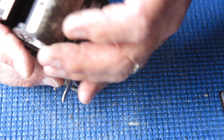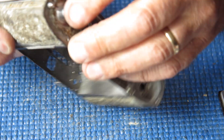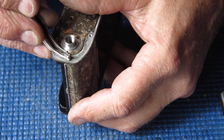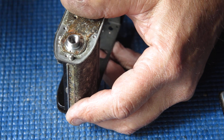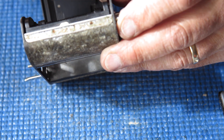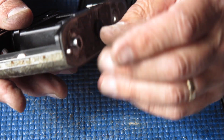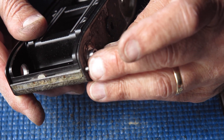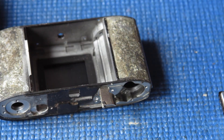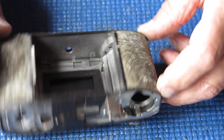I'm checking the action of the back catch. These can be disassembled if they're very sticky — you unscrew the button, which just has a couple of threads on the end, then remove two screws at the side, lift the plate off, and the bracket and return spring come out with the button. Putting them back together is a bit more entertaining — I normally use a pin vise to hold the button while screwing it back in, as it's just too short to grip with your fingers. So these parts need to be cleaned, and then hopefully the camera will be all reassembled and back to go.